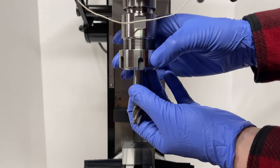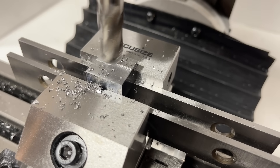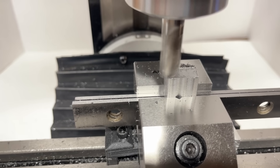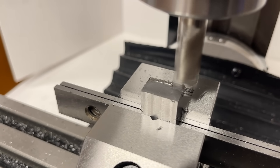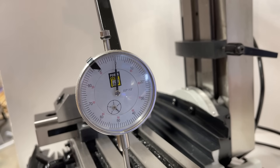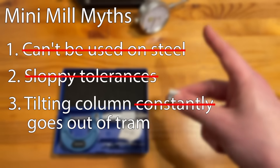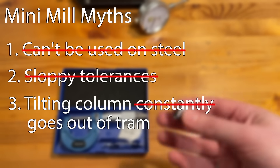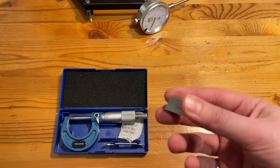Before we go, let's break out that 12mm end mill again and see if we get any more shifting when we cut with it. I'm going for about 10 thou of cutting depth to simulate a light surface cleanup pass like before, but this time we'll do it in steel and not aluminum. Is anyone else feeling a bit nervous? Okay cool — zeros all around. I think that about rounds off our list. We'll call it two and a half myths resolved. The tilting column seems like it can be an issue if you don't tighten it down enough, and despite the fact that it didn't move once I torqued everything down, my confidence is shaken, so I'm probably going to make some changes in the future to maybe make that connection a little bit more rigid.